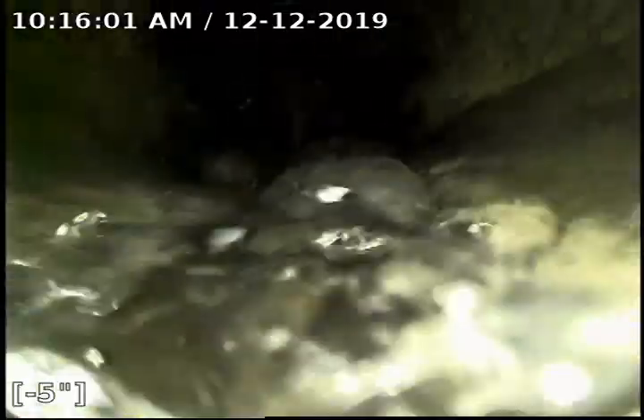We've moved over to the clean out located in the garage wall. We do have a hose down the line. This is unit 3408. We're going to be checking the serviceability of this line. At the bottom of the clean out, we'll zero the footage meter out and proceed out towards the manhole located in the driveway.